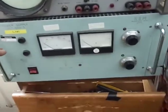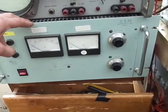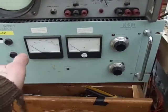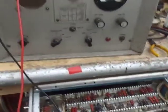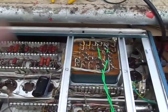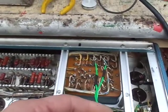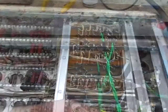First I tried to power it up using my big variable current-limited power supply. However, that just crashed because I don't think the output is floating. So now what I'm using is my Variac and isolation transformer to replace the 140-volt winding and troubleshoot the scope.